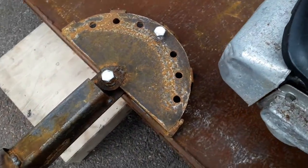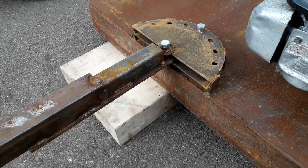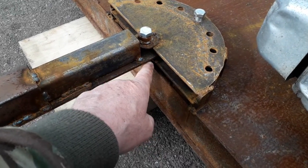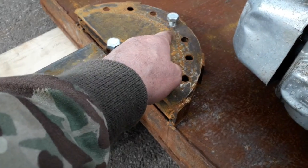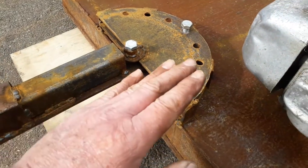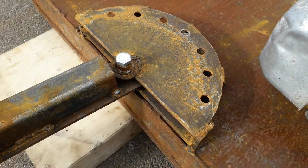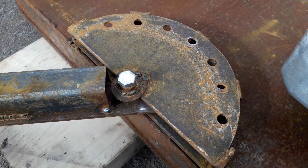It's really bloody windy here - you should use an arc welder if you're working out in the wind, but I needed to get this done. The idea is I'll put a packer in there, a bit of tube. I've got to do the same at this end so there's no movement in the drawbar, so you have it set there for behind you.